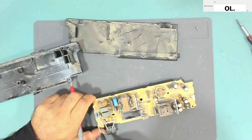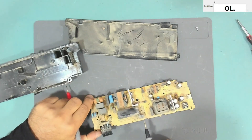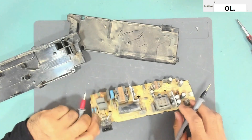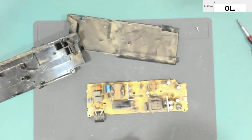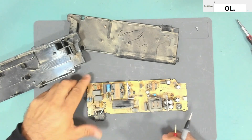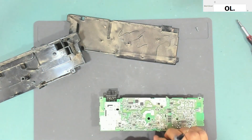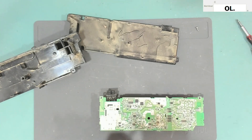There may be something wrong in the primary circuit that caused the fuse to blow. So let's check the bridge rectifier, which is this part here. We'll go to diode mode.